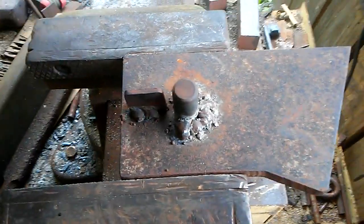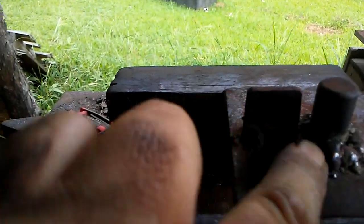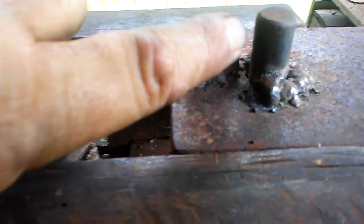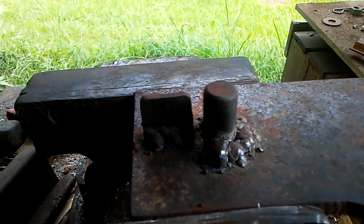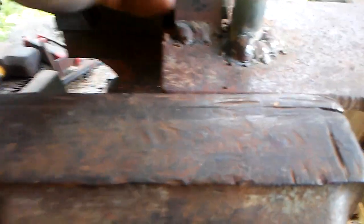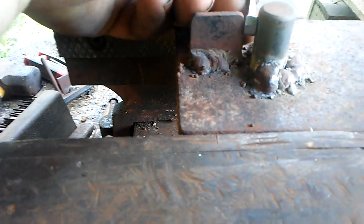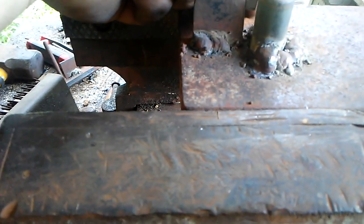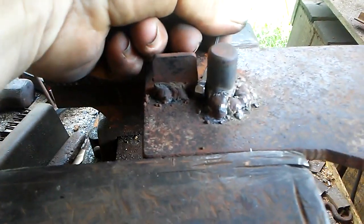This is my bending jig that I made up just for these horseshoe nail rings, prairie rings. I've got it angled for a different size metal or whatnot. I can make different sizes with these nails, putting the head either further up, which will let me make more bend around the horseshoe nail, or I can go further down and it'll make a smaller bend.